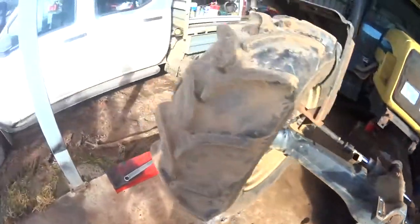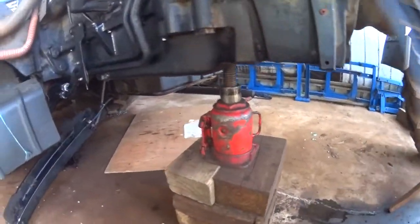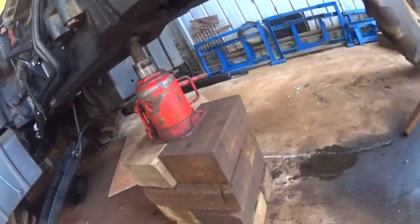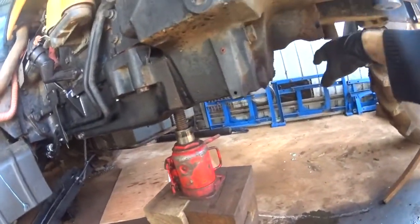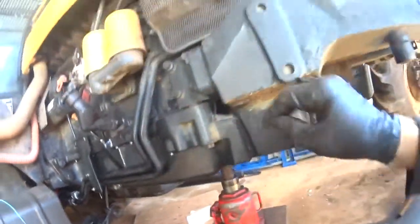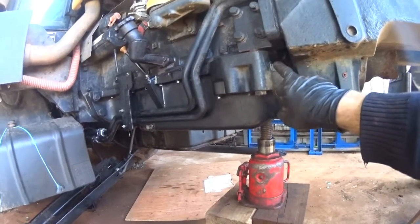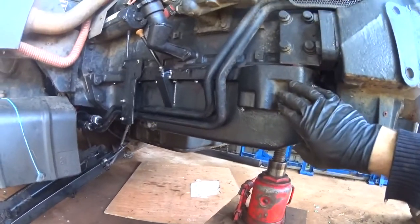Now we've got plenty of room to pull these bolts out and drop the sump. What we have to do next is put a jack up under here, somewhere here on the front. I think I'll put it here, and one up here behind the sump. We need to do that because this sump forms part of the chassis, so if we simply jack it up on the front here and we take the sump out, it's losing a lot of its strength,